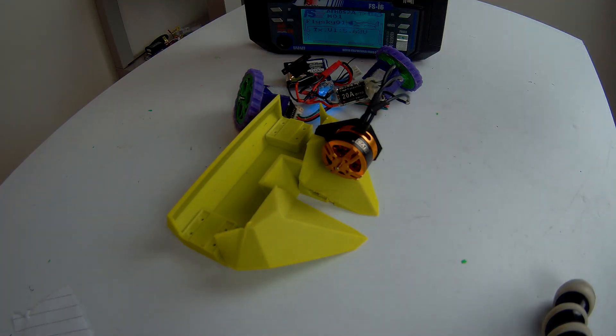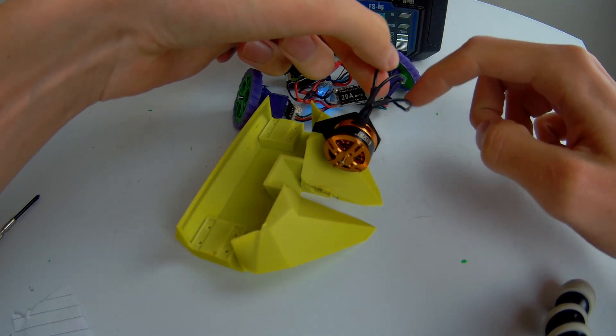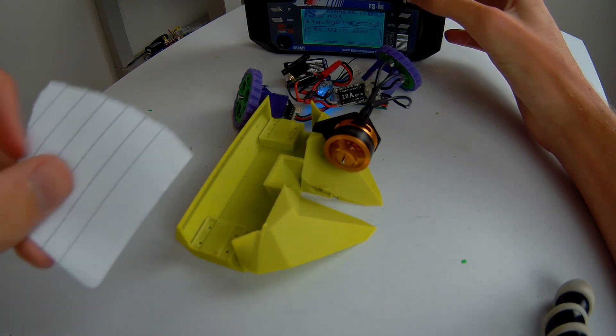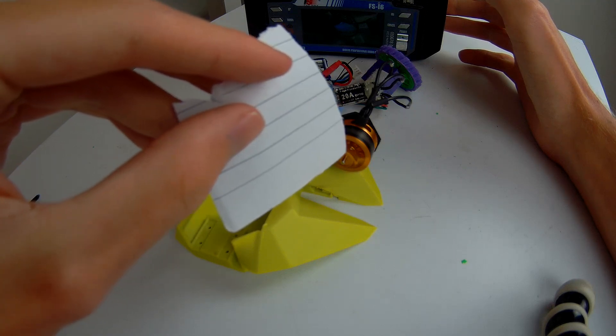Make sure that there is no weapon connected to your ESC. Here you can see I just splay out the connections to the motor, because those are still soldered and not shielded yet, so I want to make sure they don't touch. I then spin the motor up, grab the piece of paper, and carefully poke the motor with the corner of the paper.